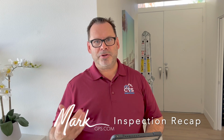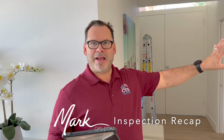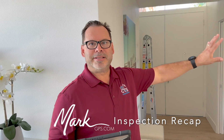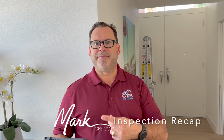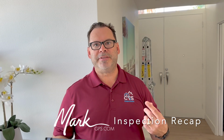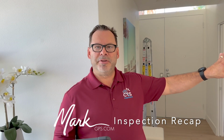Exterior electrical is all good. Interior electrical is good with the exception of the kitchen. There are 5 outlets in the kitchen on the east and the south wall that are required to be GFCI protected, because all outlets in the kitchen as of 1996 are required to be GFCI protected. So when they did this remodel, all of the outlets in the kitchen should have been GFCI protected.